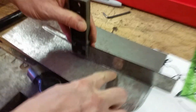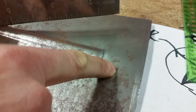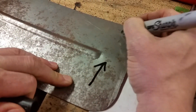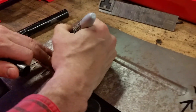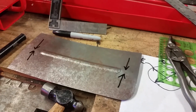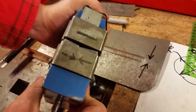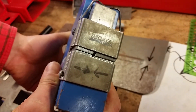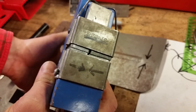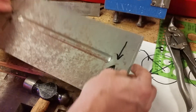Here's the problem: look at the light — you can see extra material right here. What you would do in a future video is shrink here, and shrink here as well. That requires a shrinker. This is the shrinker — what it does is grab the metal and push it together, because you have extra material. You can't be more than one or two inches from the edge. Next video we'll do that.